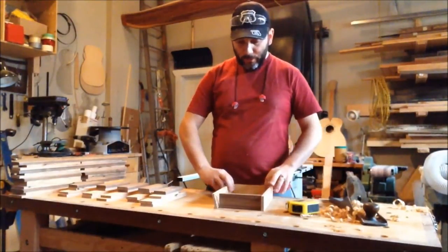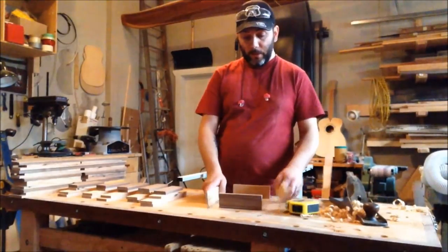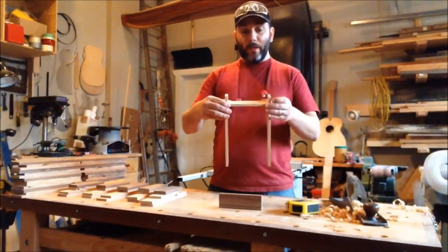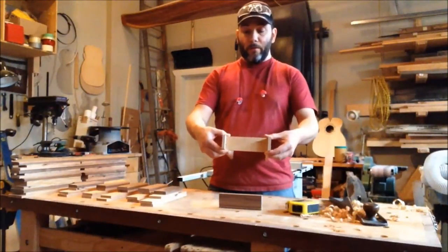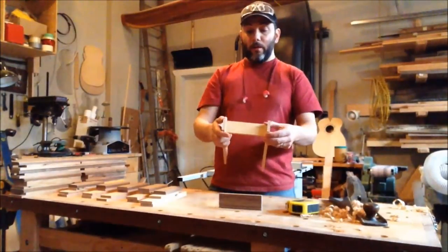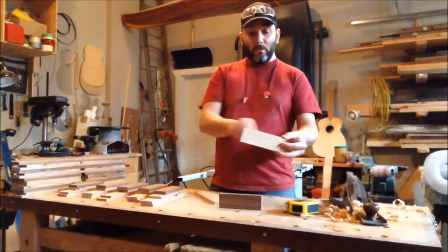As for the drawer itself, I have to put a groove on the inside of all my pieces to insert that piece that will create the bottom of the drawer. There are two ways to make those drawers. One is to leave an extra three-quarter to one inch at the back — what that does is when you pull your drawer outside of your box, it stays on the tracks and you have access to what's at the back without having to reach in. If you put items fully at the back like I will do, you might have to take the drawer out to reach small items.